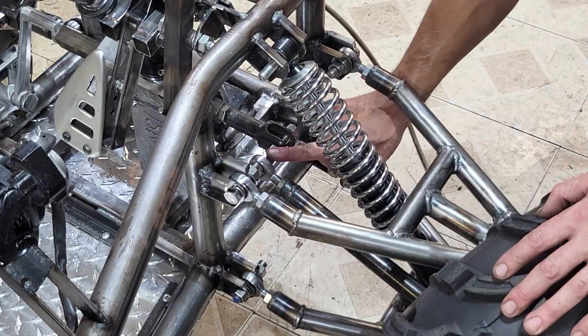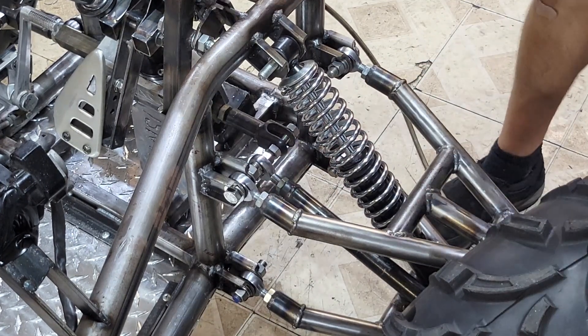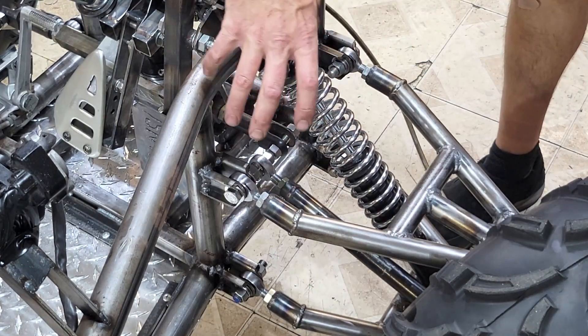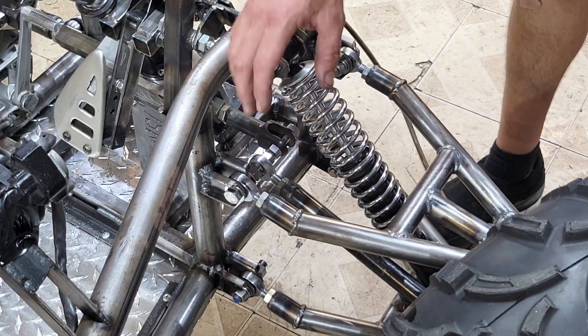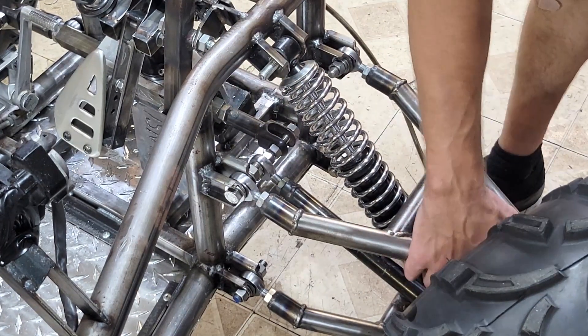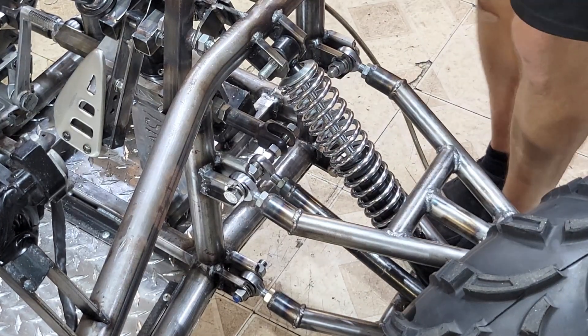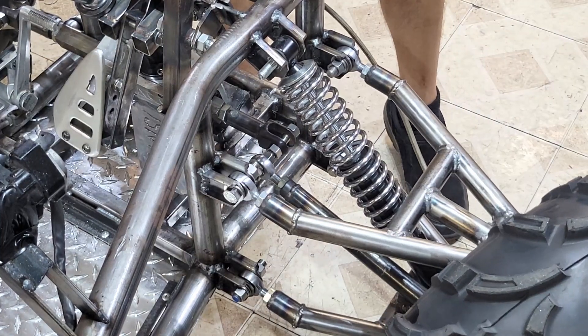This is just temporary right now, but basically what I did — I turned the steering rack 180 degrees, so that when I flipped my spindles around and moved the connection point from my tie rods to the back side, I'd be steering in the same direction and it would steer the tires in the same direction.